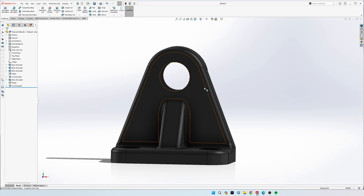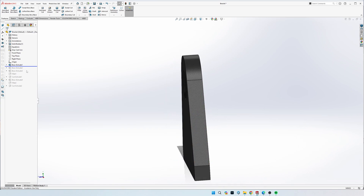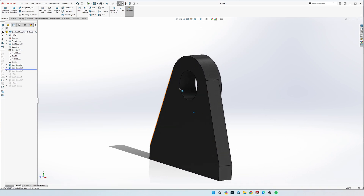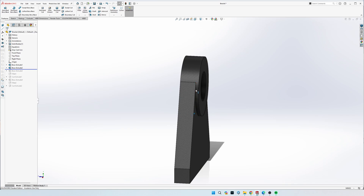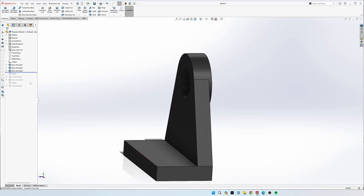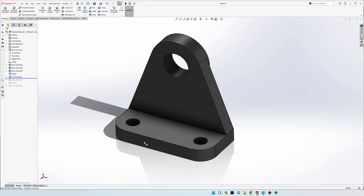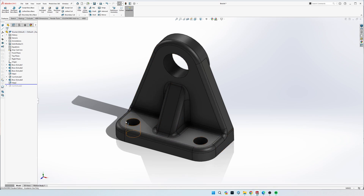Here's what I was talking about on the drawing: first I'll build the back plate, second I'll do the 2 mil extrusion, third I'll do the bottom piece that sticks out, then the fillet on both edges and the two through holes, then the triangle part in the middle, fillet everything, and then do the two countersinks.